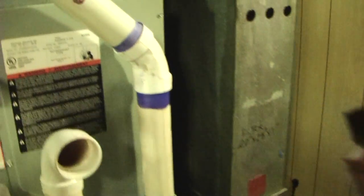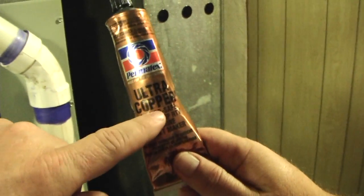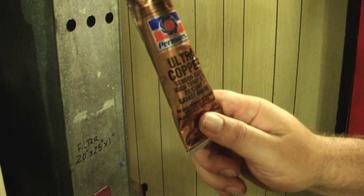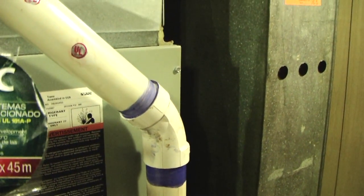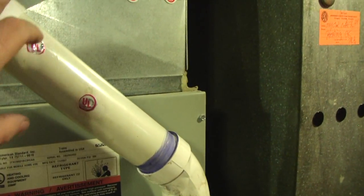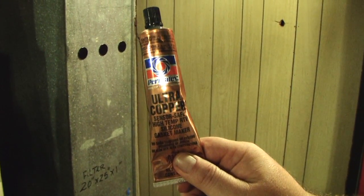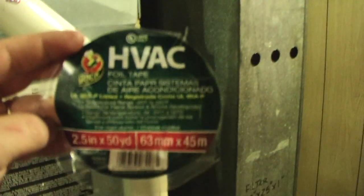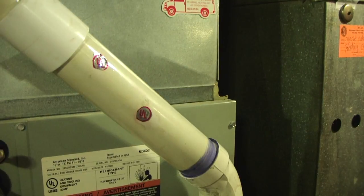One quick note: when you drill a hole through your vent pipe — it doesn't matter if it's PVC, single wall, or B-vent — you have to fill it in with high-temperature silicone. Here in Kentucky, we've got it OK'd by the local city inspectors: high-temp silicone, then cover it with high-temperature foil tape rated to 260 degrees. The 90-percenters don't really get that hot — they get up to about 120 to 125 degrees. On a B-vent, there are letters from all the manufacturers on the internet saying it's OK to drill holes; just seal the inside with silicone and the outside with metal tape. You can download that off of True Tech Tools.